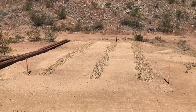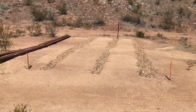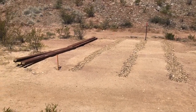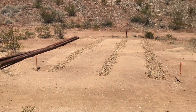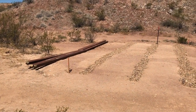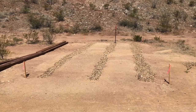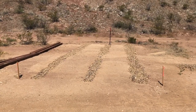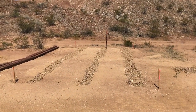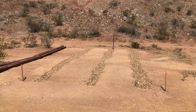I need to do one more tamp of all this gravel and dirt, make sure it's level one last time, and then we're going to lay the skids out. I'm going to connect them - make the two 12-footers into one 24-foot long stretch and also add the cross braces in between. The cross braces are going to be connected by joist hangers made for 4x4s.